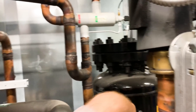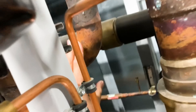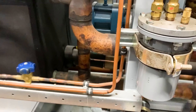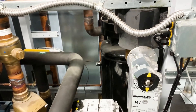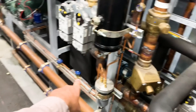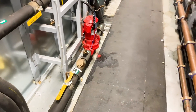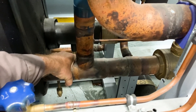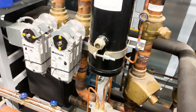As I'm looking at this more — this goes to the hot water and it's coming back here and it's very hot. Now that's going around and down to this pipe to my heat exchanger for my water, and it's coming out of there super cold. It's not going through this valve straight back to that splitting valve to the condensers — we're just taking that much heat out of that refrigerant. Everything appears to be working correctly on the control end. I'm just not looking at the piping as thoroughly as I should be, because we do have a good supply of hot discharge gas to the heat exchanger, but that water is just sucking all that heat out. The discharge inlet — I can't hold my hand on that line, it's way too hot. But this is the discharge gas coming out and I can hold my hand there all day. We'll see if it was just a flow issue because of that valve being closed.